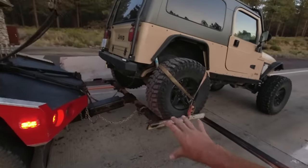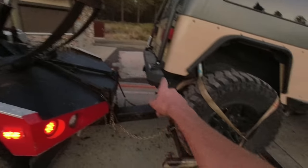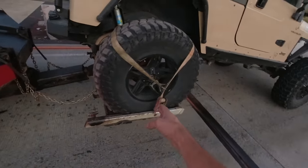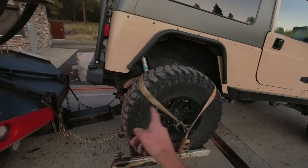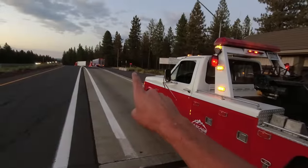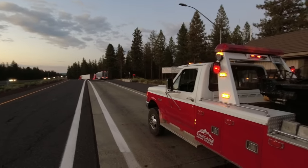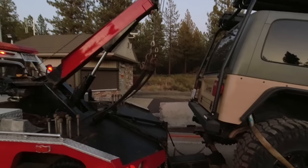The first test is on the wheel lift, as I'd be towing it down the road. The wheel lift is extended out right to where it would be even with where the sling bar would be, but being the wheels and the wheel pockets you actually have to add another foot or so. The big difference is that you are now picking the vehicle up from up here and not from the end out there, so this will be the heaviest of all the weights. And the scale reads 10,050 pounds. So we're going to pull this off and grab it with the sling.